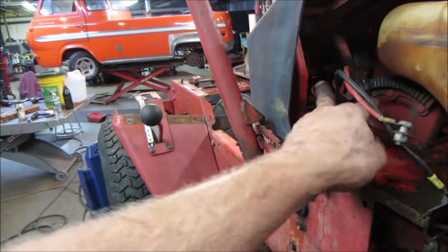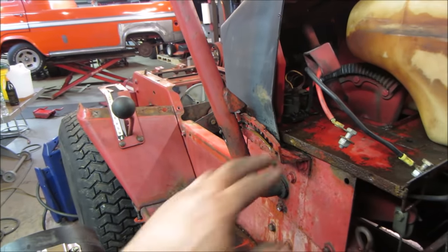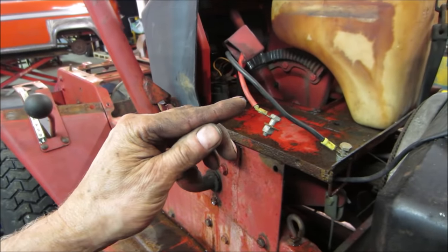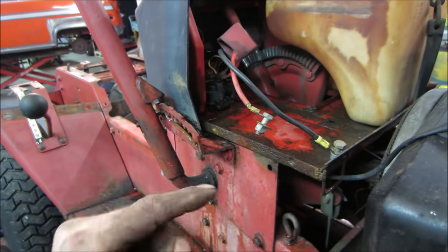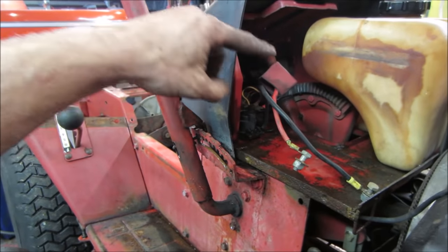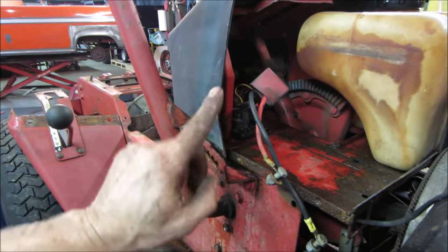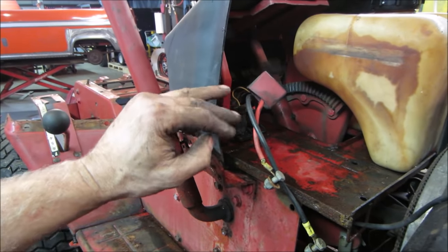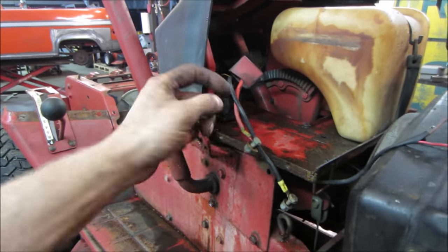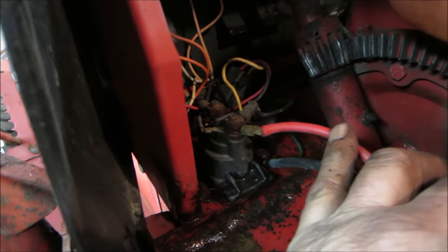That's that right there. I do believe I have another parts one somewhere. We could swap that out. Sometimes they'll clean themselves up as you're using them. What it is is a coil on the inside, and you energize the coil, it pulls down. It's the clicking that you hear. But then there's a set of contacts that make a path going across to the two big terminals, so from the battery here, the red lead, to the solenoid. When you fire the key, it fires a little winding, pulls a set of contacts up. One side contacts the side coming from the battery, the other side contacts the post going, the heavy wire going back down to the starter. That's why on some you can cross them with a screwdriver to get them to start. And that's what that is.